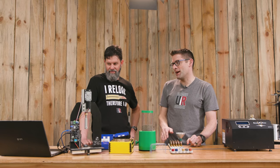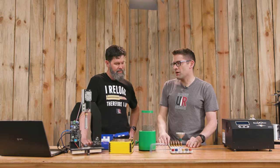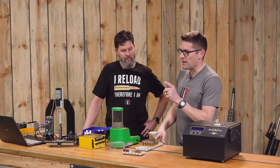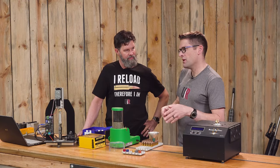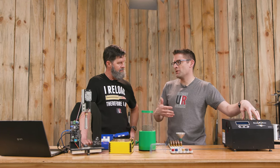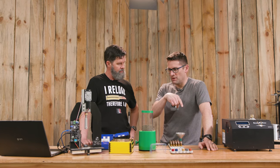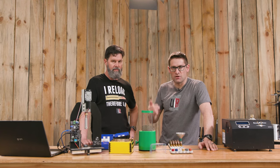What we can see is our process looks really sound. This is like perfect ammo to go shoot. I've had brand new ammo perform incredibly well — you don't always have to fire form. I would shoot a match with brand new brass if I was confident with the result. We're going to continue doing experiments with the AMP press. If you have an idea for one you'd like to see — whether it be annealing specifics, like under-annealing a little bit and then over-annealing a little bit to show what the total softening annealing value does to bullet seating force — if you click on the first link in the video description you'll see our initial testing. So let us know what you'd like to see and we'll take some of your ideas and you'll see those on the channel.